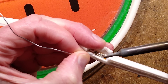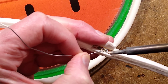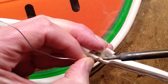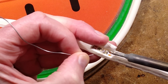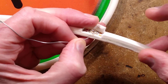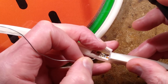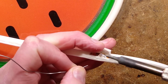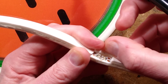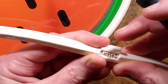They make this LED tape — I just heard the LED tape move. I'm going to blob that off, which is annoying because this is effectively two bits of tape. I've blobbed across between positive and negative — that's not going to work. That tape has actually moved. I may have to put a little more bridge in. I could go across the two pads here. As it's flexed round, the two are very loose and not quite going together. I'm going to have to put this in a vice to actually clamp it together.